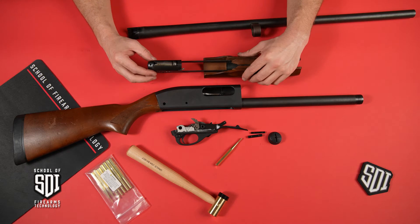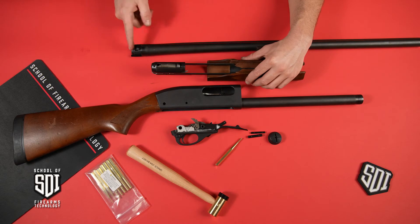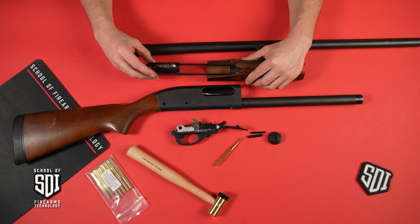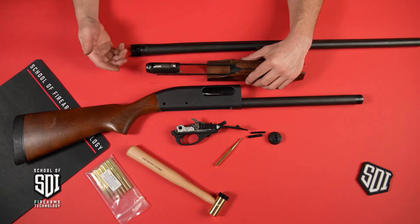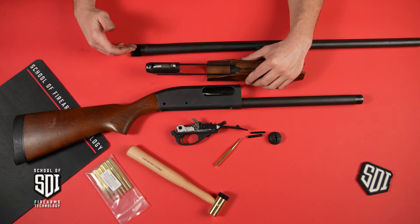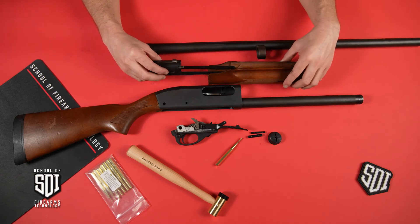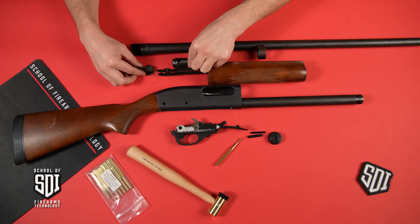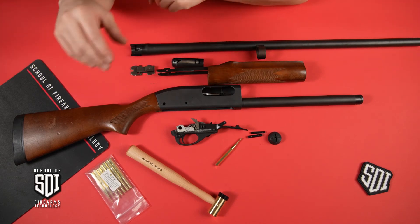The bolt will be in the forwardmost position. When the front of it contacts the breech, it will slide to the rear, which will pivot this locking bolt up into the locking recess on the breech — what's known as the barrel extension or barrel shroud. That's what locks your system. That's a safety mechanism, sealing the chamber and all those gases so they go to the front instead of rearward into your face.